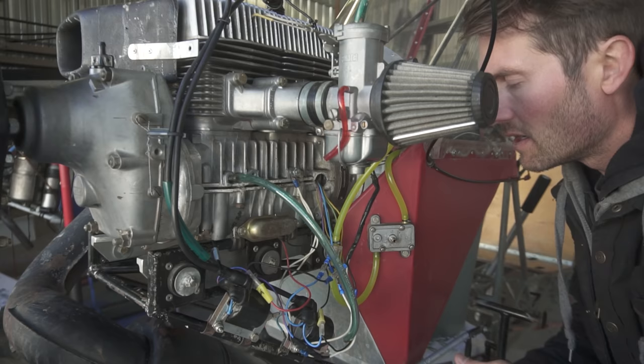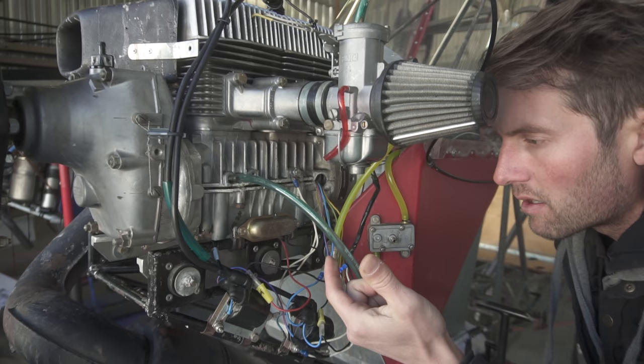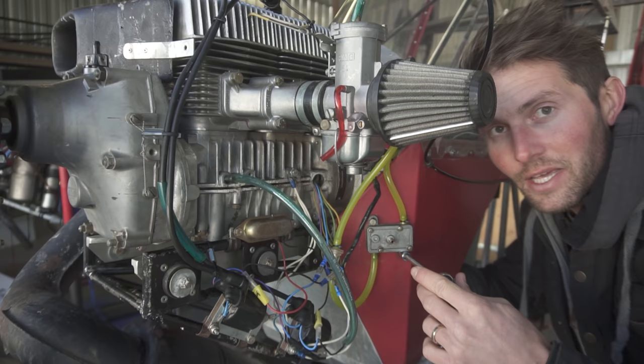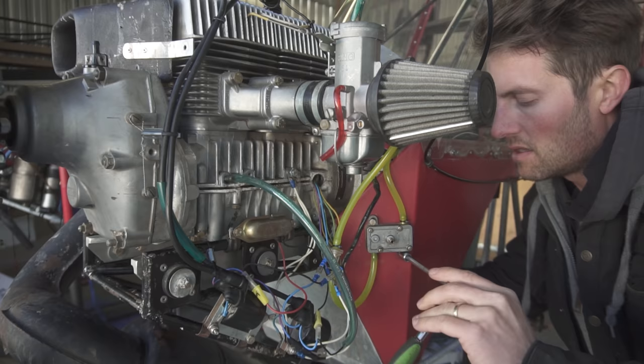All right, so I'm gonna move the fuel pump up to here because someone actually commented saying they had a 447 fail on them because the fuel pump was lower than the suction line and oil would go down and basically clog the suction line and then prevent fuel from getting pumped. So we're gonna move this to here. If that guy didn't comment, this fuel pump would still be here. So yeah, I get to learn and then you guys get to learn too. Pretty cool. I really am gonna mount that fuel tank up higher also.